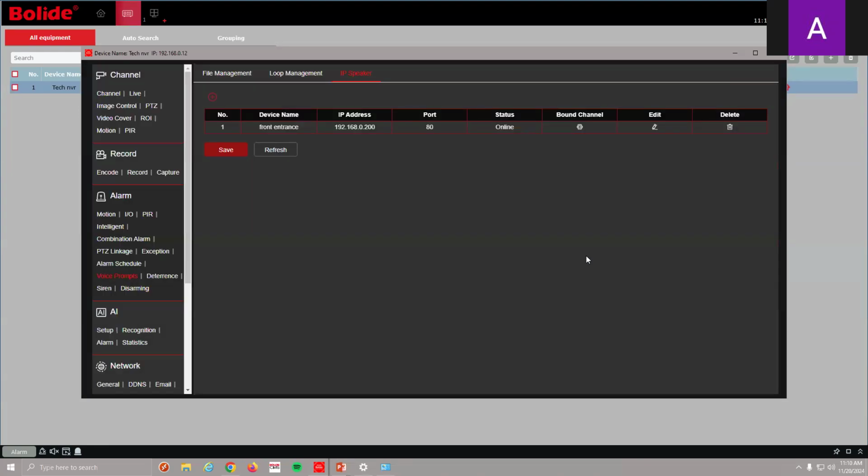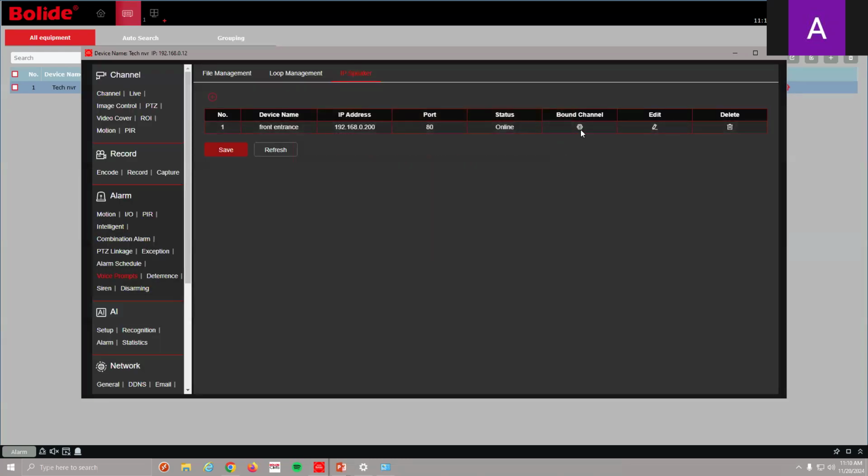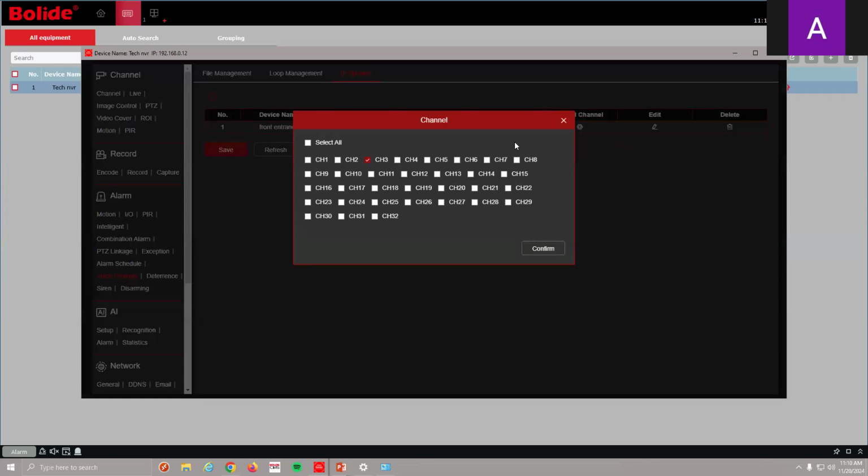Can you bind it to more than one camera? Yes, I can bind it to every channel if I wanted to. You can see all my channels there. If I wanted to do select all, I can do that. So if you have a front entrance camera and you don't want it to go off from activities from other cameras, then you just select one. Or if you want it to go off at any point there's an event on any of the cameras, you can do that scenario also. Correct. Or mix and match. Maybe only your outside cameras or however you want to configure that. Let me cancel that because I already selected. Let me make sure channel 3 is already done.